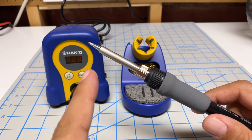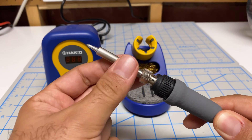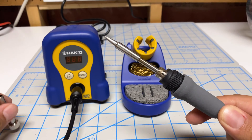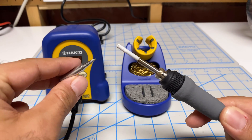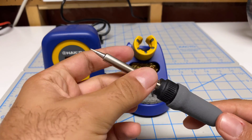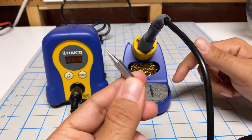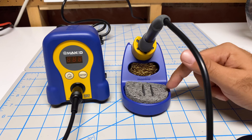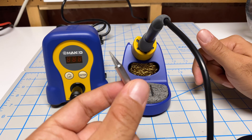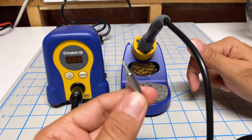I've got it all set up. I want to show you how quickly you can swap these tips out. All you've got to do is open up this nut, and this piece here actually doesn't heat up too much — it'll get hot but not as hot as the tip. Put that aside and this comes right out. Here is the heating element. You put the new tip in, put this on, tighten it down — not too tight — and that's it. About 10 seconds to change out a tip. Unfortunately the new iron doesn't have a place to store the tips. My old one had two channels along each side where you could put extra tips, which is useful for hot swaps since they can be pretty toasty.